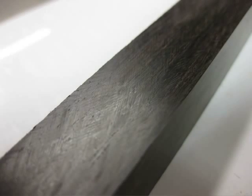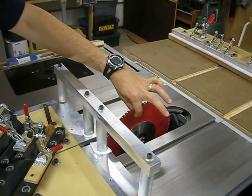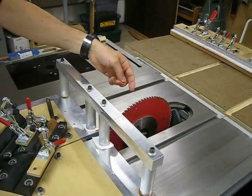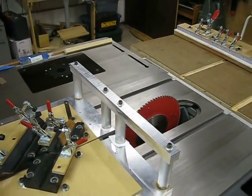We were just talking about this on the African Blackwood — how the surface finish looks on the side. There are some swirl marks that you can kind of see. The blades make a big difference too. The blades I like are the Freud Ultimate Cutoff with 80 teeth and a full kerf plate on the blade. I like the plate to be the full width of the kerf because it's more material, more stiffness, and it doesn't vibrate as much.